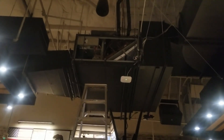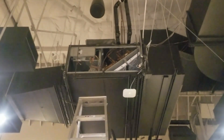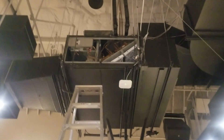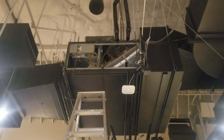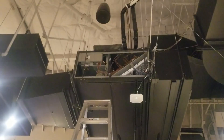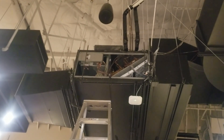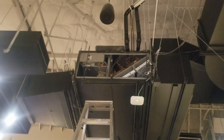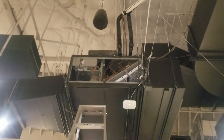This unit is leaking water everywhere. The drain pan is not plugged up, and we've had a history of a refrigerant leak on the first stage. We're going to check everything out right now. So far the blower assembly or the air handler has water signs in it, but the drain pan is not full, so we're going to do an analysis on this unit, check the refrigerant charge, and then possibly do a leak check.